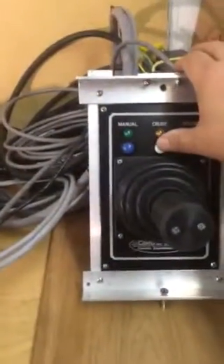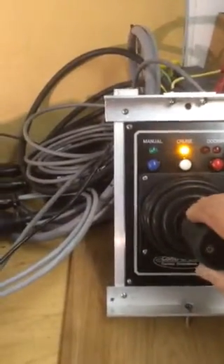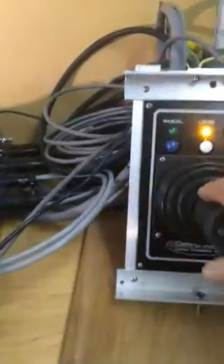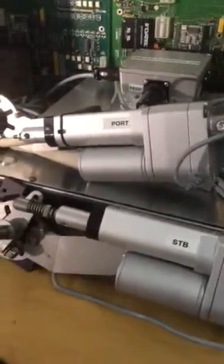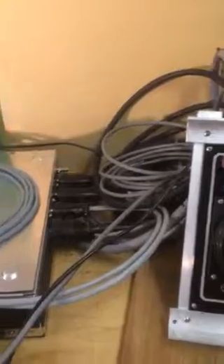Here's the main CPU. On the cruise mode control, if we go to cruise control, it gives you the same kind of control — in this custom application it gives you manual control on the deflectors, leaving them wherever you move them. If you move them all the way down they stay down; all the way up they stay up. This normally would also have a trim control and you also control the Z-axis steering on the vessel.